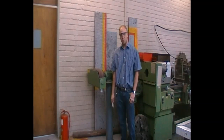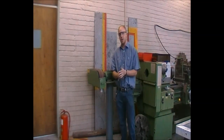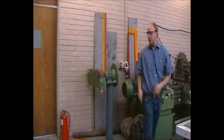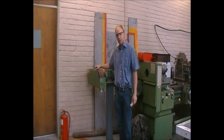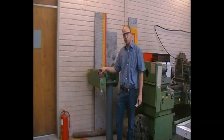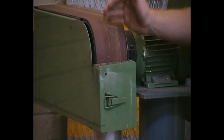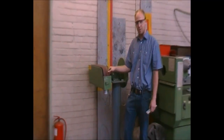Please wear the appropriate PPE such as glasses, closed shoes. Make sure there is no loose clothing and no gloves are permitted. Make sure the grit on the sanding paper is still good, make sure it's tight and running in a straight line. Also make sure the distance gap between the bed and the sanding paper is no more than 1 millimeter, as parts can get jammed in there and break.